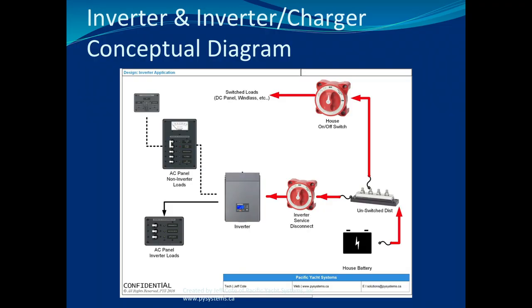So it's a code word. It's an inverter and a charger, but the owner read the label. You can't blame the owner. It's an inverter, I'm connected to shore power, I don't need an inverter, turn the inverter off. But they don't realize it's an inverter charger. And if you turn the breaker off to the AC feeding the inverter charger, your charger will never work, because without AC, a charger cannot create DC. You can't go without an input and create an output. Everything has to have an input. So without AC coming into an inverter charger, you will never, ever have a charger work.